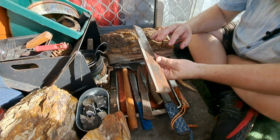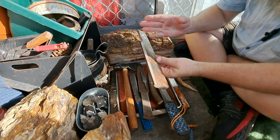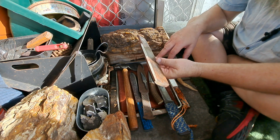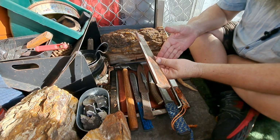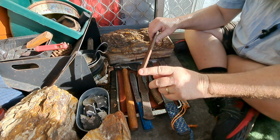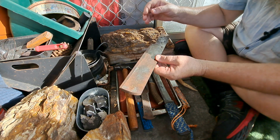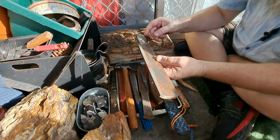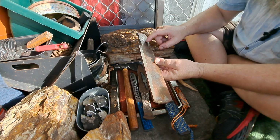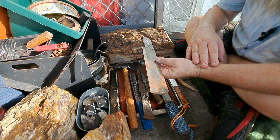The competition chopper, it's turning out really well. I've got a little bit of a skew here, but just the grind, but I'm going to put a guide on, that'll get fixed up. I'm going to steepen the grinds out here. Once they're steepened down a little bit further, I'm going to keep that edge pretty well that thick. I'll steepen this grind down as much as I can, and once my fast quench oil turns up, I'll get it quenched. I might talk to Andrew. I think I will drop some 15mm holes in the handle here just to lighten the handle up, get the weight forward.